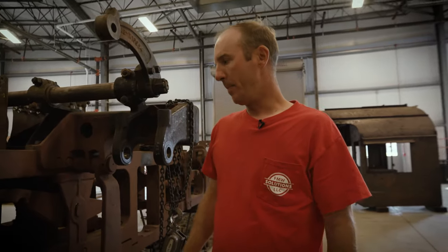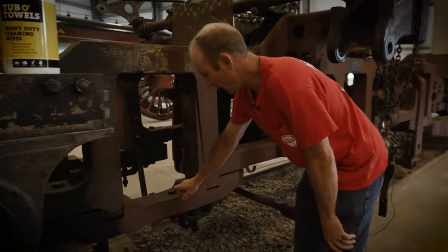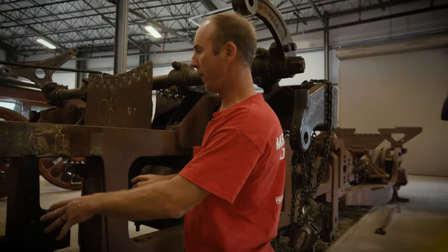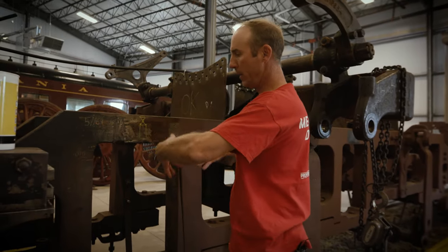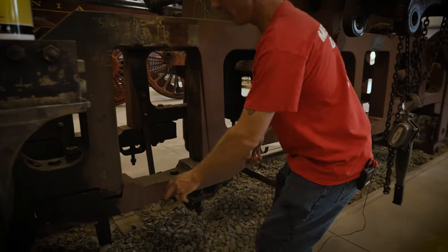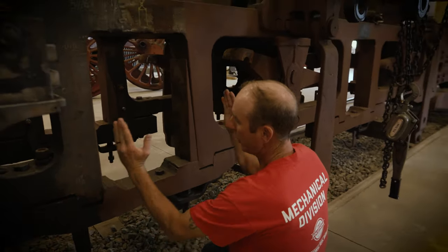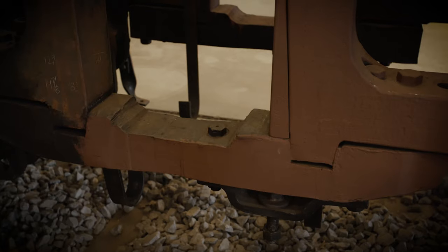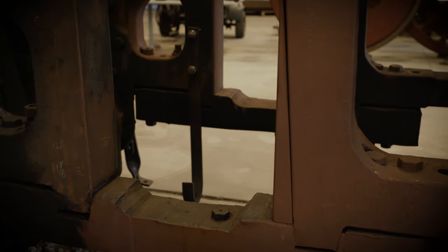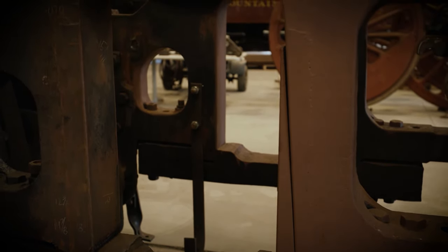One of the key parts of this frame — and to any bar frame or any frame on a steam locomotive — is the binders. All these binders basically make up the bottom half of the frame, which makes the frame more rigid. Without those, the frame could flex at this upper bar right here. These binders are fit on wedges at the bottom of the frame, and as they're pulled up tight it secures the bottom of the frame — they're not just in there flopping around. That will also change these pedestal openings, so we'll make sure all binders are fit properly before we take any accurate frame measurements to tram the locomotive.